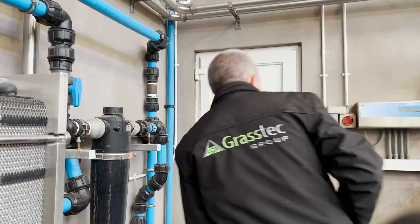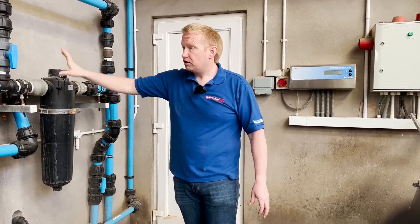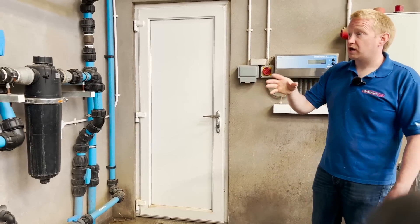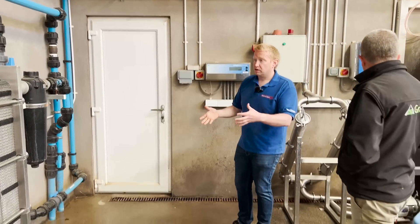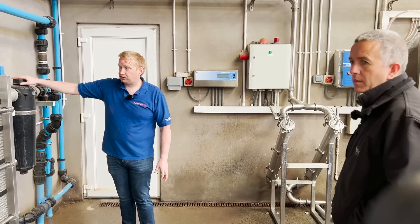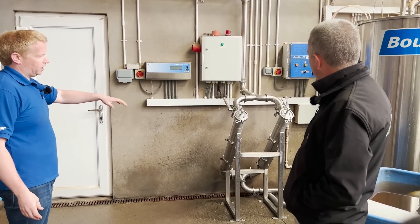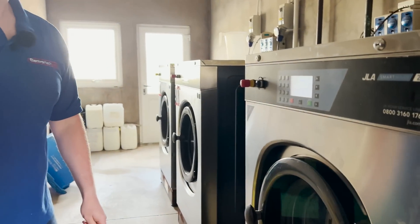There's a water filter for the water being pumped through the plate cooler — it loops through the filter and back again, protecting the plate cooler from any dirt. Given the scale of the operation there's a lot of water going through it, so it's better to have a filter right beside it. The filters are mounted at an angle for ease of operation — easy to pull out without reaching high — and when the valves are there, no milk is lost when pulling filters out.